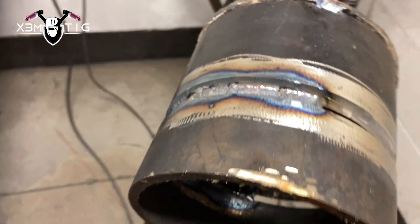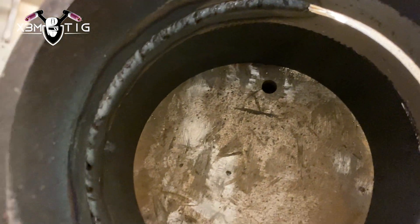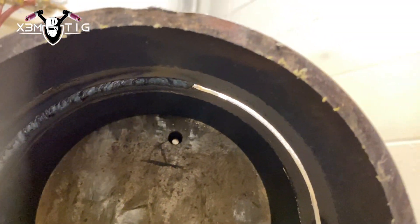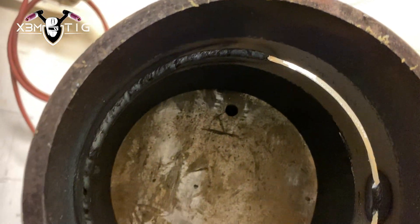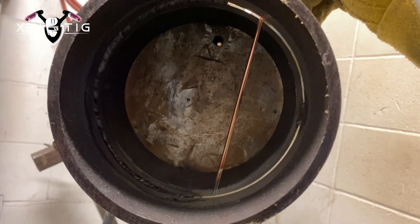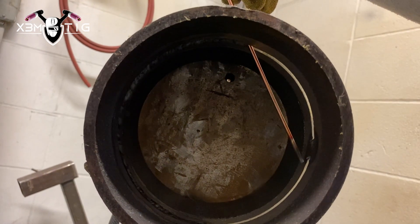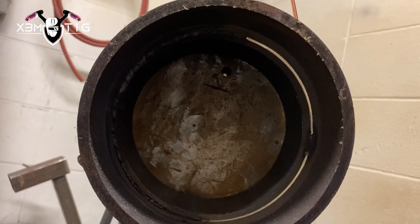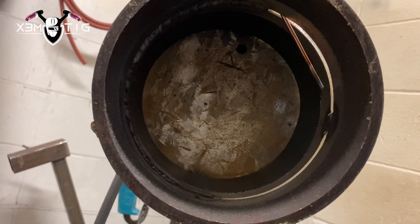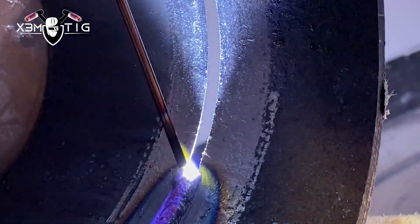This is all freehand except that little section on the top. This is how the half of the pipe looks — a nice solid root. This is how you rotate to do back feed: once you reach that tack, pull it out, finish from the outside and bring it back in. The same thing when you pass one o'clock going to 12 — pull it out and do the same thing.